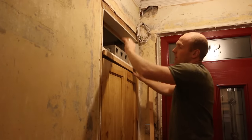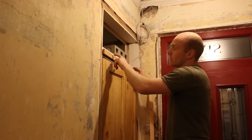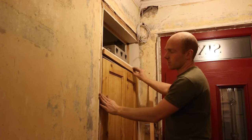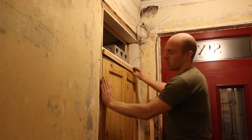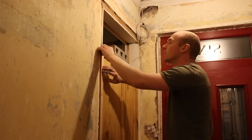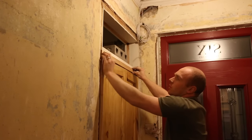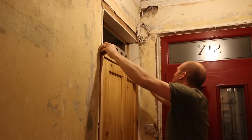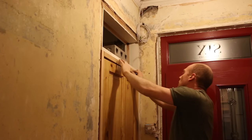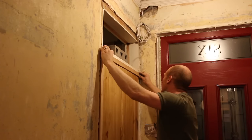I'm going to be boarding in this area here, but in order to do that I need to bring out the door frame by 12mm — that's the case on the side as well because there's a lip — so that way you can plaster up to it flush. Also by doing this I'm actually hiding or disguising the track system for the bifold door, because that was a pretty ugly thing to look at.